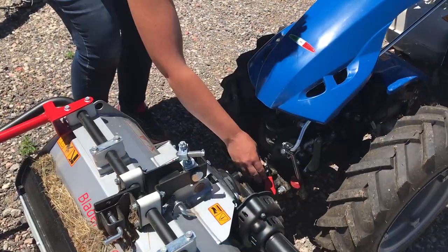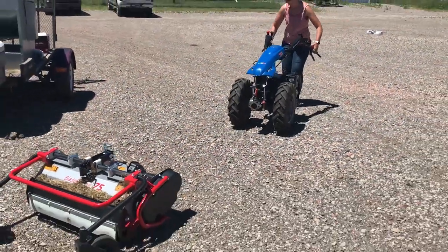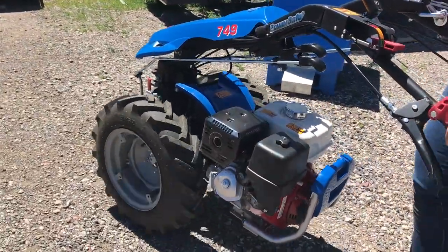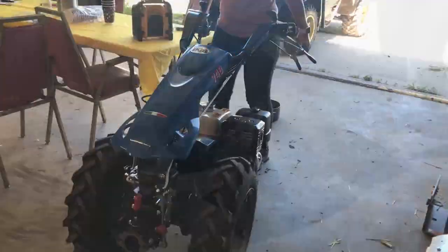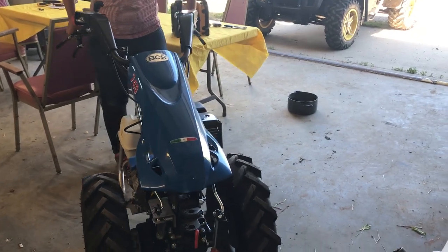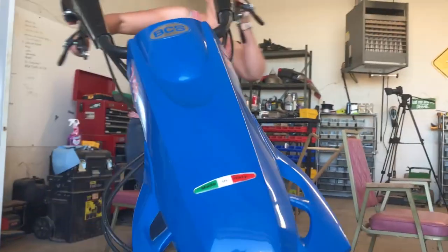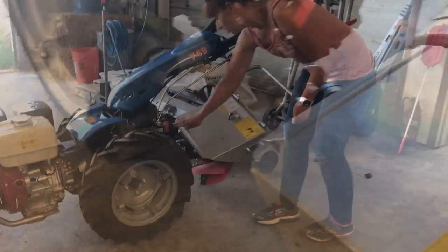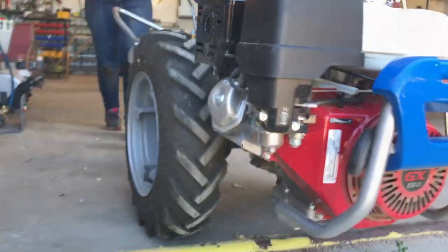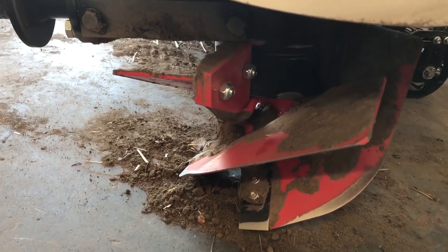The flail mower is hooked up to the tractor and we need to drop it off so that we can hook up the rotary plow. It's as simple as lifting a pin and backing away from the mower. Then it's into the shop to finally put the tires on the right way. The BCS handlebars rotate 180 degrees — we rotate according to which attachment we are using on the PTO. The flail mower goes in front of the tractor while the rotary plow and precision depth roller go on the back. The PTO and gear shift controls get popped out, pull a lever, and the handlebars spin. Then we are able to back up and into the rotary plow attachment. The PTO is lined up and once everything is flush, the pin can be dropped back down and we're ready to head to the high tunnel.